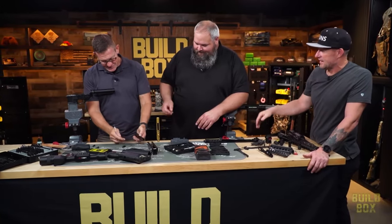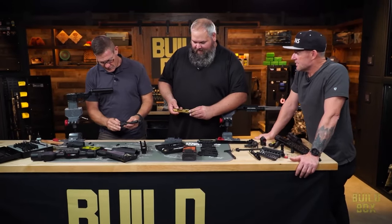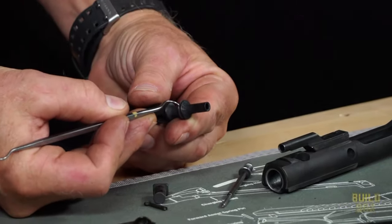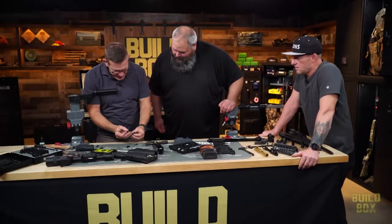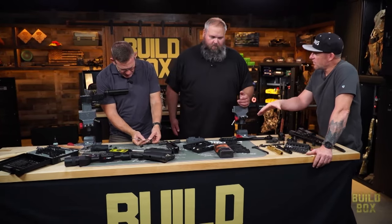That's ridiculous. On contact. And there's got to be something with the bolt or the gas rings or something in that, if they're even there. They're probably not. After seeing the ejector spring. Hey, look here. Half of one of the gas rings is broken out. You can actually see it. I'm gonna pull it out. Oh, yeah.